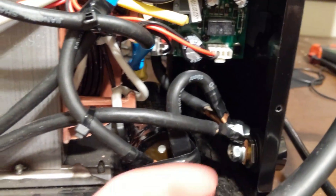I don't know if you've shopped for copper wire lugs for larger gauges like 8-gauge, but they are absurdly expensive, and I needed about 12 of them. So I went to Lowe's and bought quarter-inch soft-drawn copper tubing, used a tubing cutter to cut it to length, fed my wire into it, crimped it down really tight with a pair of vise-grips, then got out my propane torch and soldered it up. I had to take one apart because I messed up a connection — it was really hard to get apart — so I'm pretty confident these are going to hold together in the welder.